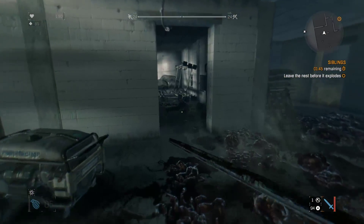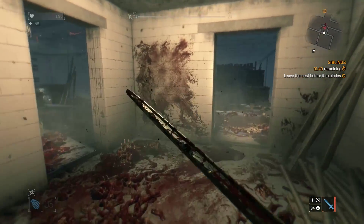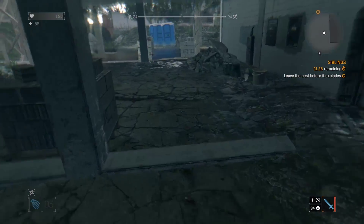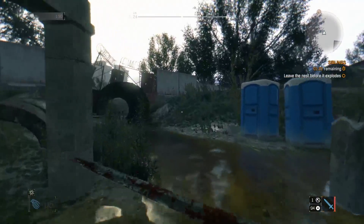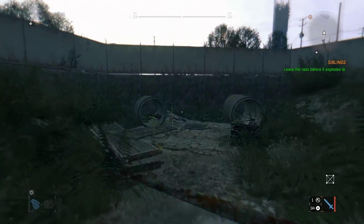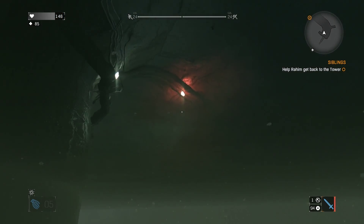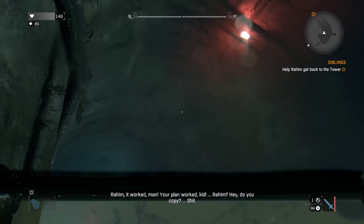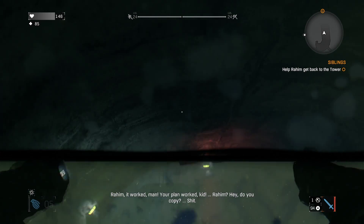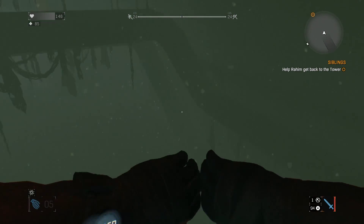So this is the first test. I haven't changed the position of the microphone at all — I just turned up the 20dB boost. You can probably hear me quite a lot louder, but the quality is not as good. If you put the microphone a bit further away from your mouth you'll get better quality, but then background noise comes in as well. This is the first test; I'll move on to the second one.